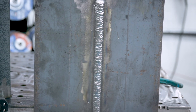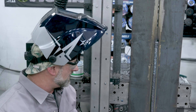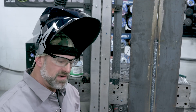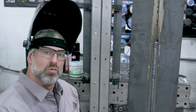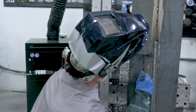All right, I'm done. As you can see, I welded my two feet — put the root, fill, and a single cap pass on it. You can tell my speed and everything was just about right because when your flux falls off like that, you know things are right: your speed, your control, your back and forth motion, your weave — everything was just right. It didn't come out that bad; I think it came out pretty good. So what we'll do next is hook the machine up and see what the machine's going to do.